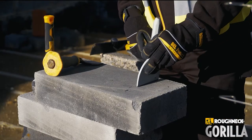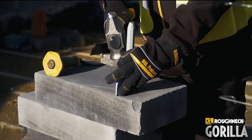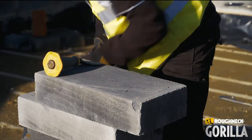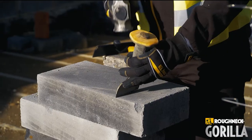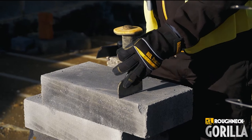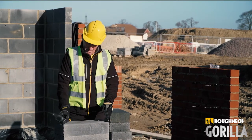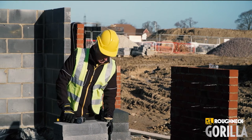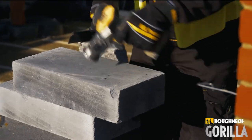When cutting a block, you can only cut part of the block and there's also a danger of it coming off a striking point and hitting your thumb or your finger. They tried to get over that problem by bringing in the mushroom guard to protect your hand when cutting it. But a lot of bricklayers don't like using them because when you cut the block and follow through, this bit of plastic comes down and hits you on the back of the hand.